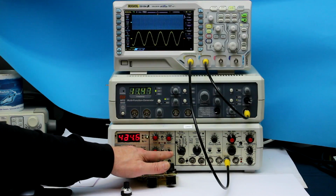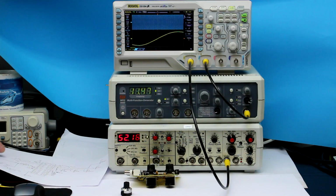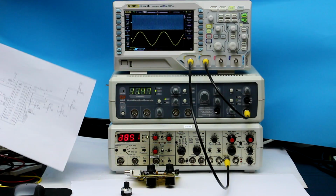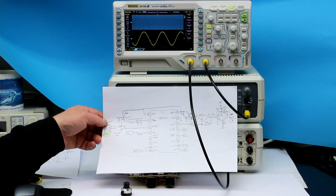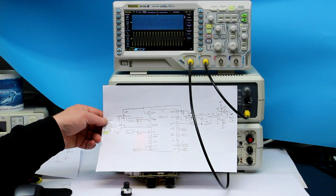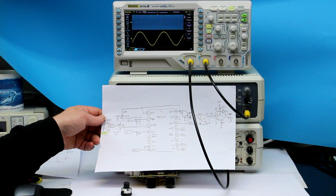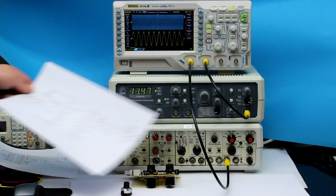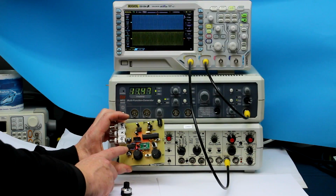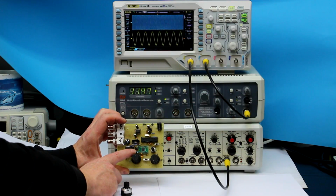as a kind of digital to analog converter, I used the PWM output and a very steep, I think, 8-pole filter, while here I used a modern digital to analog converter, the MAX5136. It's a 16-bit converter with 2 outputs and an internal reference, so you need nearly no external circuitry. But what I've added is 2 little jumpers to make the output either unipolar or bipolar.